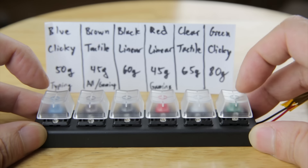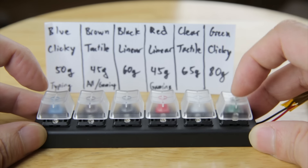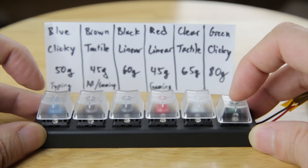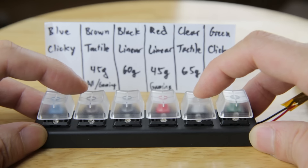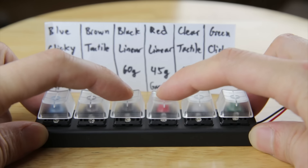I have a feeling this green one is probably malfunctioning a little bit because it's supposed to activate right after it clicks. Instead, this one I have to push a little bit harder — it might have been damaged a little bit when I was soldering. The blue has the tactile bump, the brown has the tactile bump, and the red and black don't have a bump so they're linear. I removed the cap and massaged the switch a little bit, and it seems to work now. I can push it halfway and it will light up.